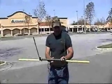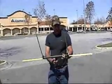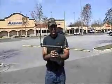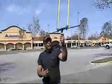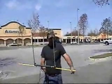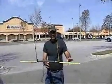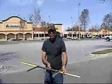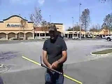I mark here — I look for a null in the direction-finding. As you swing it around, you have a sharp null when you're looking for it. These are quarter-wave ground planes. I made them out of tape measure and PVC tubing.